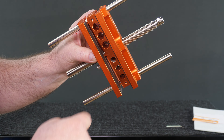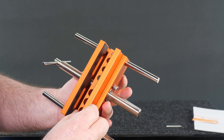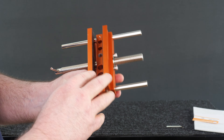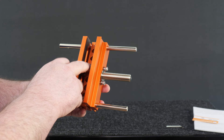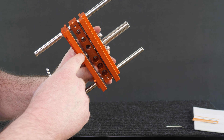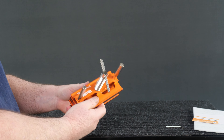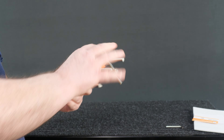The downside is that where there's no steel bushing, there's only aluminum. If you get a hardened steel drill bit, the flutes of a drill bit up against aluminum are going to chew the crap out of it - that's just the end result. How long will this last? I don't know. I put maybe a dozen holes through using the three-eighths bit on this one and I've certainly chewed up the anodized orange color on it.